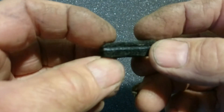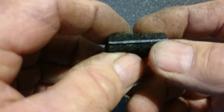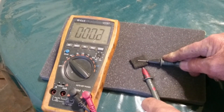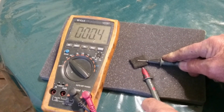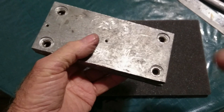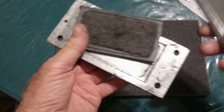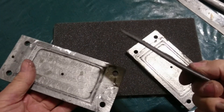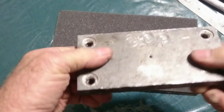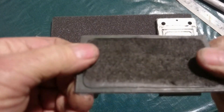If you look you can see the plastic — HDPE plastic — with carbon either side, heat impregnated into it. It conducts electricity through but won't let liquid pass. It has a very low resistance from one side to the other: 0.3 to 0.4 of an ohm. Here's one of the plates I made up. I've made some round ones and some square ones. Basically it's a piece of HDPE plastic — milk bottle plastic — with carbon felt on the side, put into an aluminium mould, clamped up and put in the oven at 250 degrees for about an hour and a half to two hours. Then you get it out. It conducts electricity but is waterproof.